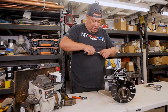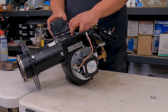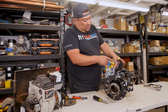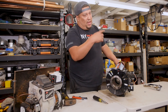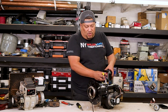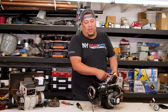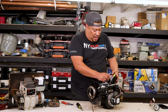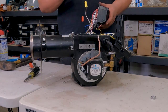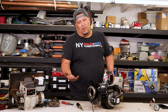Right now we're going to take her off. This is a primary relay — it's labeled right here, it tells you everything. I don't want to get too deep into the wiring in this video, but we'll make another video for that. We just want to show you what an oil burner relay looks like. It gives you all the wire diagrams: L1 means hot, L2 means neutral, and it tells you where to connect the motor, the igniter or transformer, the delay valve, et cetera. I would always advise you guys: read the instructions first. They're color-coded, so it's pretty self-explanatory.